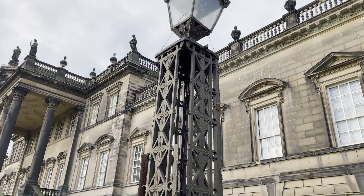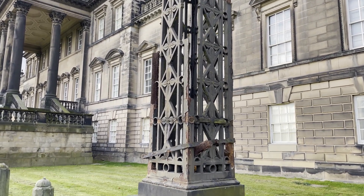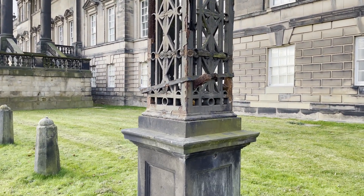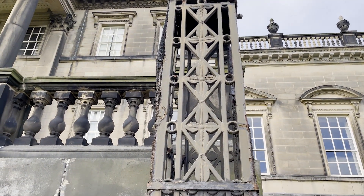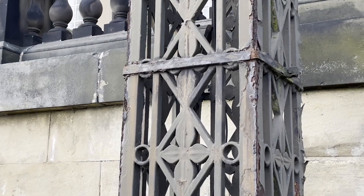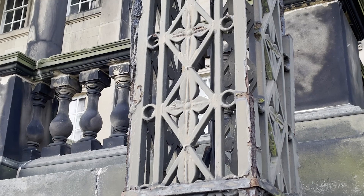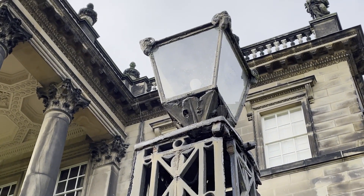It was clear that each of the cages is made up of several parts. They comprise four tapered panels made in grey cast iron and were originally sand cast as flat-backed panels with mitered and screwed-together joints in the corners running the full height of the hollow cage. On the top of each cage is a decorative cap, again made of grey cast iron, and the lanterns sit on top of these.